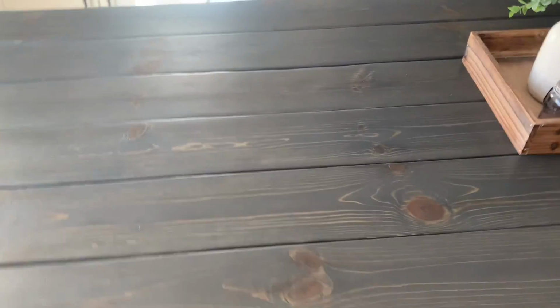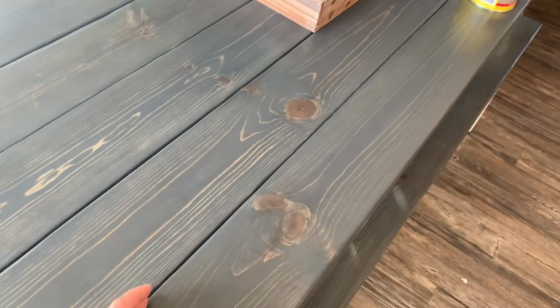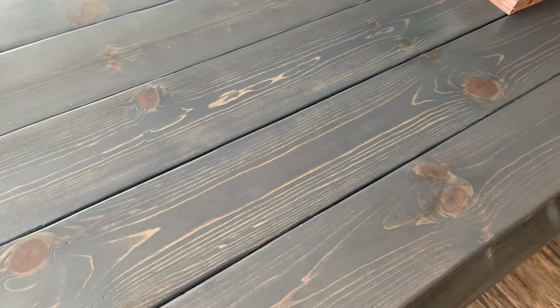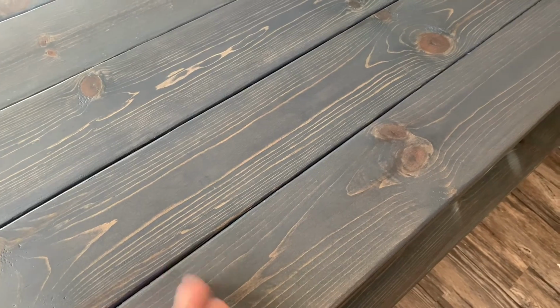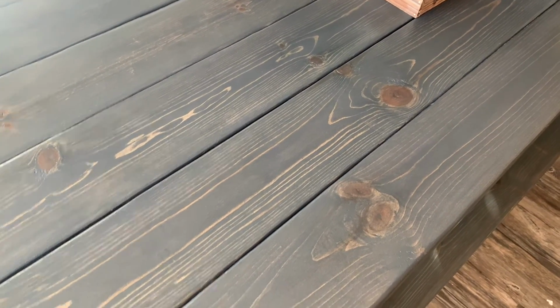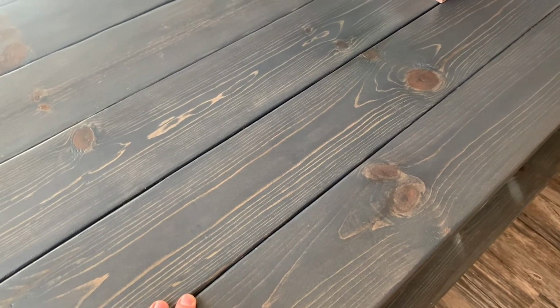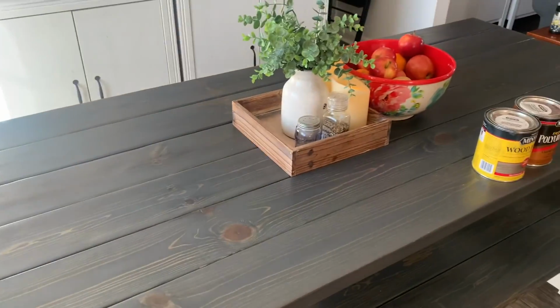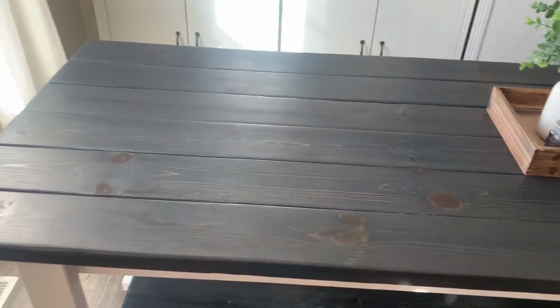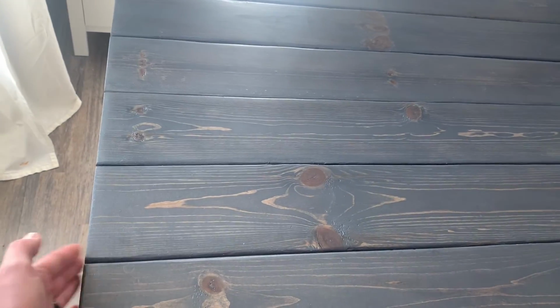And I would recommend then taking your wood planks to a table saw and cutting off these chamfered edges and butting them up with clamps and basically eliminating that seam. It's a lot more work and a little bit more money. The planks that I bought here were actually just stud grade 2x6s. They were pre-cut to length already, so I didn't have to cut the ends.